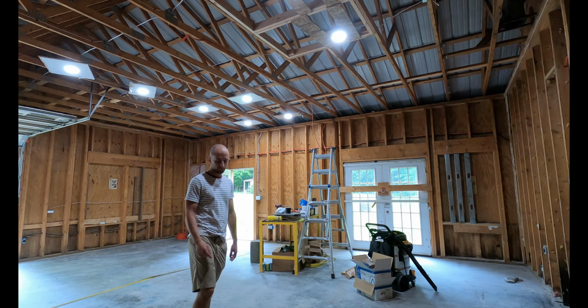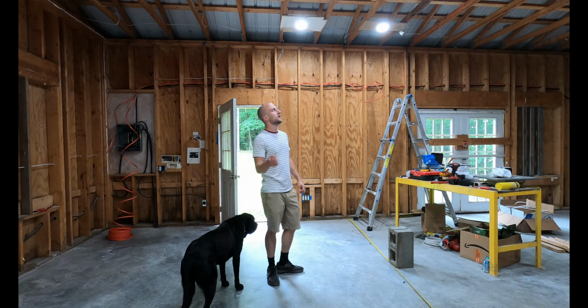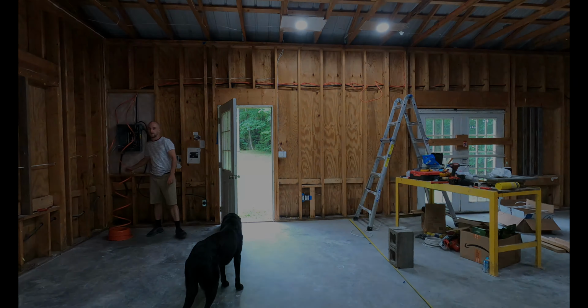That sucks. I switched which side of the rafter the wire was ran on and stapled it all alongside that rafter, came down, stapled it to this board here, and now I ended up with this amount of slack right here. So now I just gotta pull this back through, and I'm gonna leave extra here because I'd rather leave extra and not need it than need it and run that length of very expensive wire again.